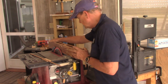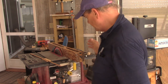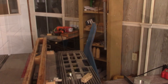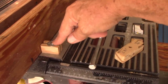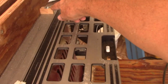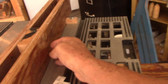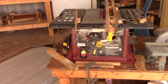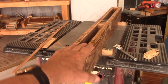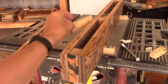I made this extension here to help support the whirligig blades I was making, but it still takes a lot of setup time. I thought this might be helpful: I drilled and tapped the aluminum table 10-32 and put these blocks on here. The blocks are just a block of wood with a slot cut in it — I did a drill and a saw, made a slot so I could adjust them, and they would hit up against the rip fence and hold it in the exact position for cut after cut, keeping my blades a consistent width. But when I knock this down to do other operations, I have to take these out and reset them again.